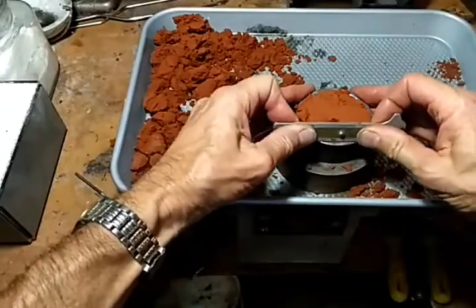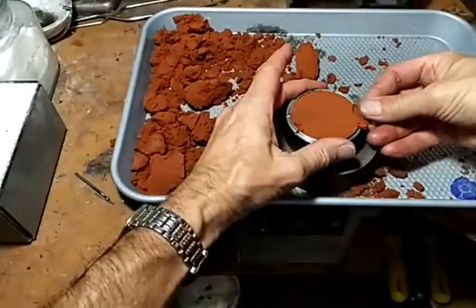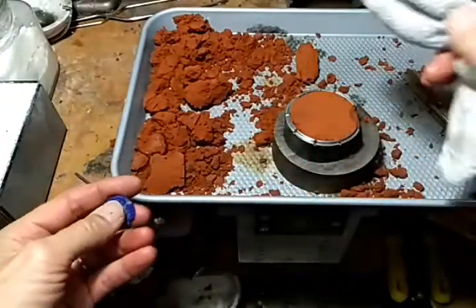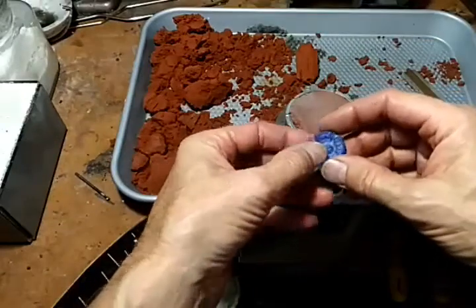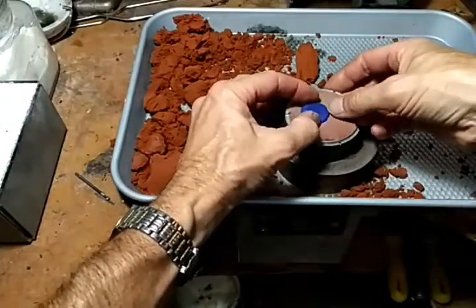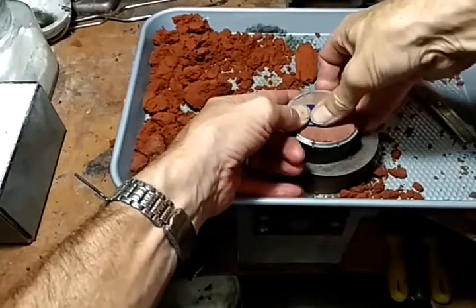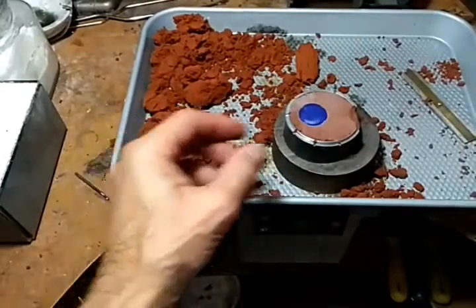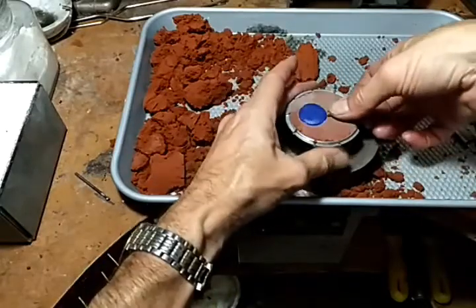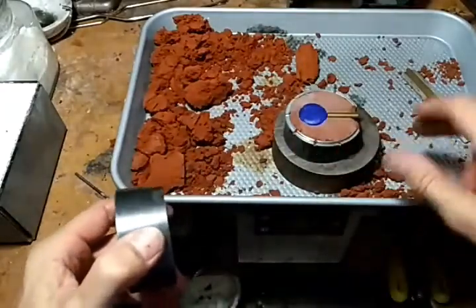Find something flat that you can scrape it off. I'm going to powder this and push it down in. I'm going to move it way back to the back here because I want to get a long sprue on it — carefully push that in about halfway. I've got this brass piece of tubing here I'm going to use for a sprue. Just like that. Make sure there's no sand in the channel.